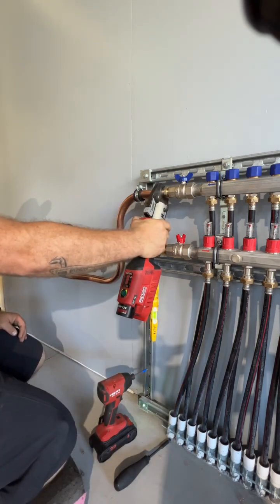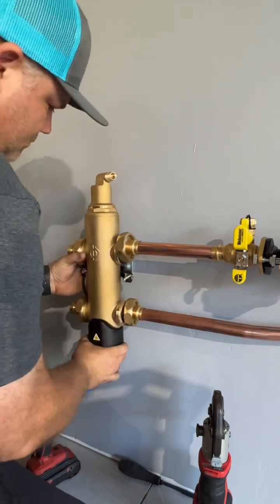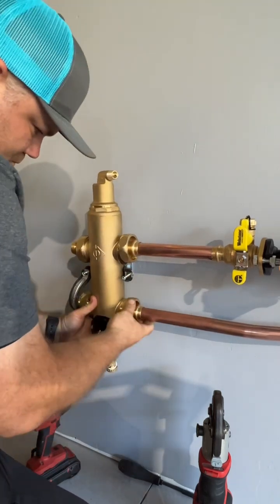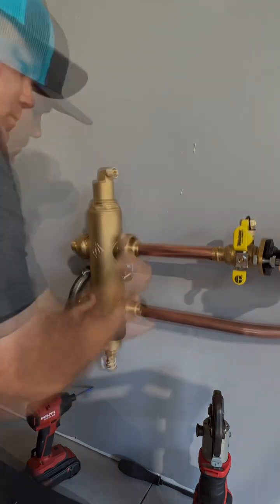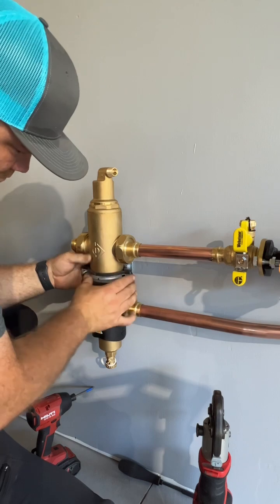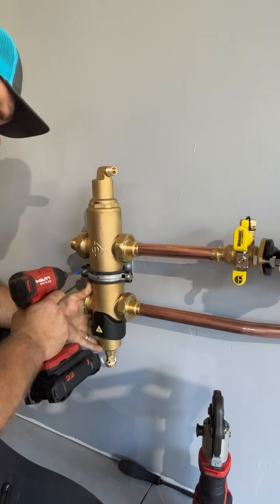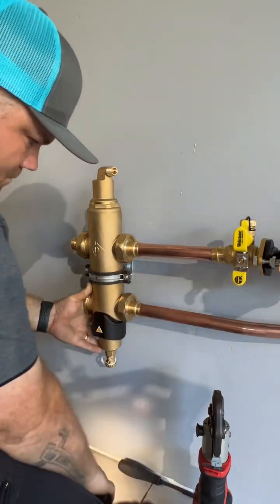Saved me some fittings, and I think it looks pretty nice. Using the rigid press tool as always. So that big valve right there has a magnet, some screens, air valve, a drain — it's got all kinds of stuff going in it. It's a very cool, easy way to eliminate a whole bunch of connections on your system and a whole bunch of different components. Really like that valve a lot.